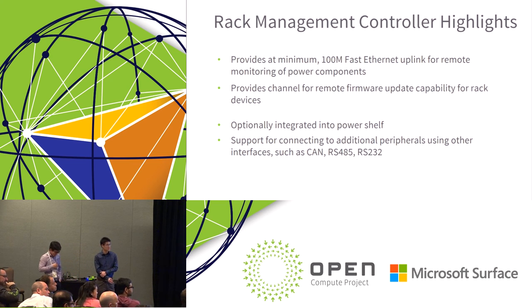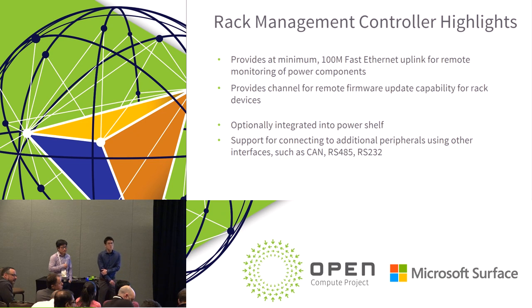Yeah, this is Dave Alexander. I'm director of engineering at Google, responsible for a lot of these areas. To your specific question, at least within Google, we don't have facility-level battery systems. All of our UPS is distributed, in rack, and it's maintained by the same hardware operations personnel that maintain the servers and storage. It's certainly a major factor in what we look at, and one of the reasons we've moved to lithium ion is it has a longer life and maintenance is easier. Because ours is all distributed, it's made for a fairly streamlined maintenance operation.